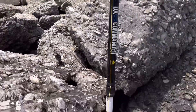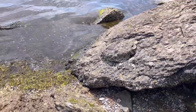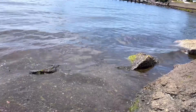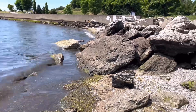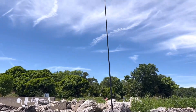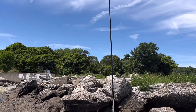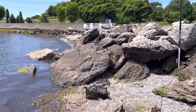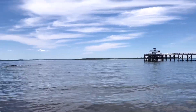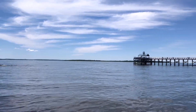This is a vertical half-wave for 20 meters using my 10-meter DX Commander pole and some 20-gauge wire. I'm going to do something a little different — I'm going to use a 17-foot counterpoise into the salt water. I don't normally do that for half-wave verticals, but let's see how it goes. SWR was a perfect 1-to-1, so I'm gonna spot myself and call CQ POTA. Let's make it happen!